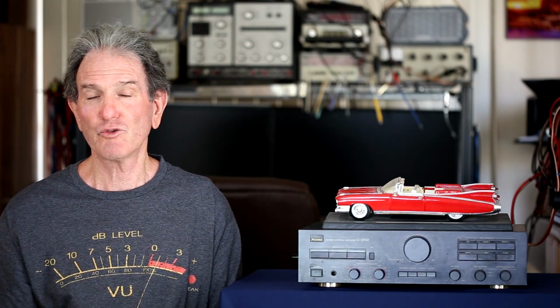So if the person who ends up getting this, because my buddy Ian sells stuff, has an amplifier with a reasonable amount of gain, the Carver's 29 dB, I believe, for the cubes, probably you're not going to really notice that little spot in the volume control where it starts getting scratchy. But on older gear, sometimes that happens. Maybe people take apart those Alps things. There are some screws on it, but that's not anything I would want to get into and see if I could repair it. So to me, it's usable, and for most people, they're probably not going to be moving the volume control that far.